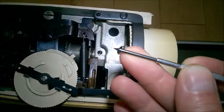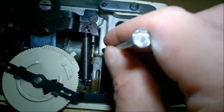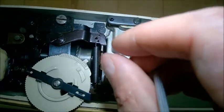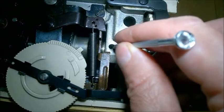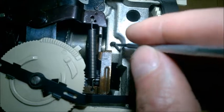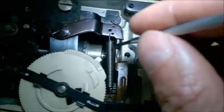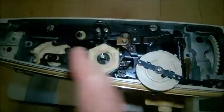I have this small tool — it's not a screwdriver, it's like a pointed pin. You can try pushing a little bit on that material, without too much force — maybe the remaining material is really thin and you can puncture a small hole through it to let the oil leak onto the shaft. But it's not always possible, and I suggest you don't force too much because you can cause a dent in the shaft or friction on the shaft itself.